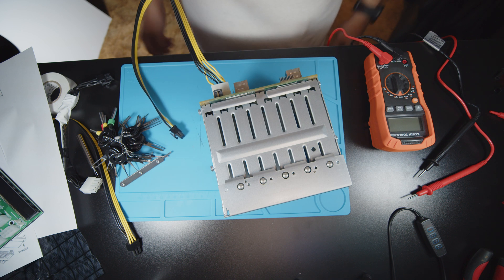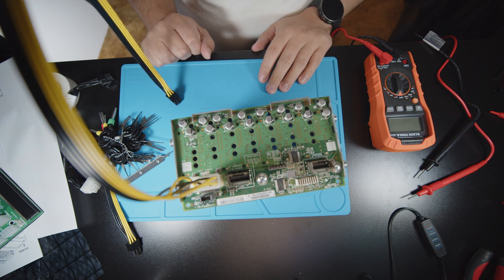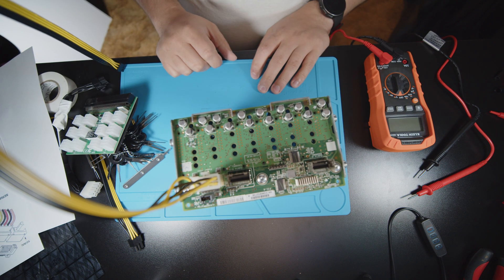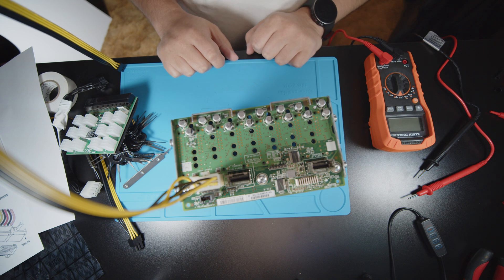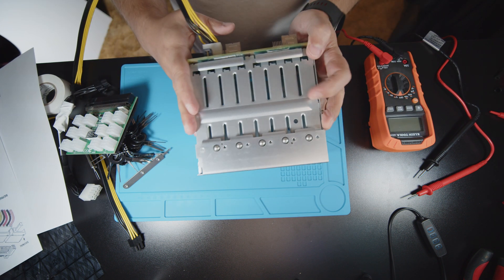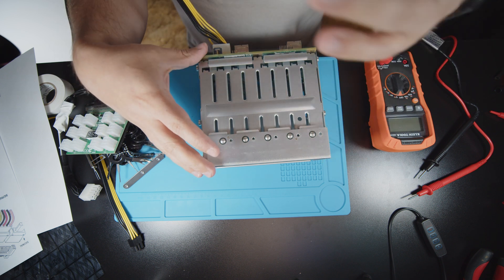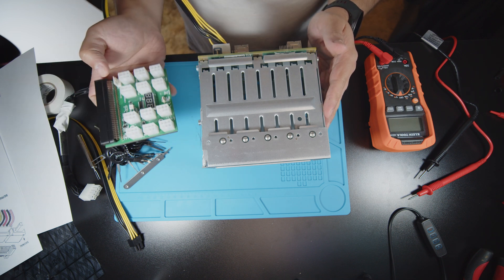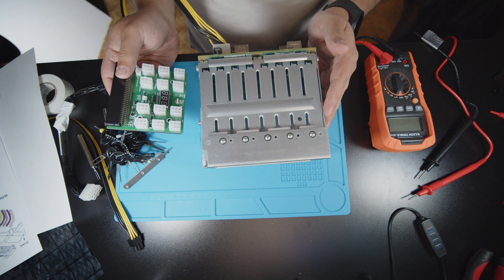And there you have it — that's how you do that. Once you have a 12-volt server PSU, just hook the SAS cables in and hook that to an HBA and you're good to go. What I'd recommend is get a 120-millimeter fan, zip-tie it here, and have it blowing air because this thing does get hot. I'd actually recommend hooking it straight to this power supply so whenever you turn on the drives you're also feeding power to the fans.